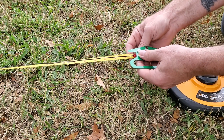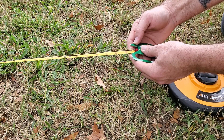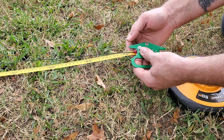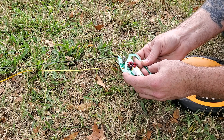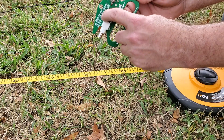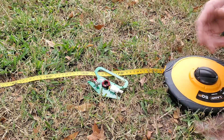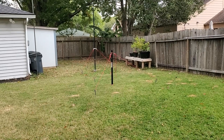So looking at my measurements here, I'm at 28 feet 7 inches, or in metric that would be 8 meters 72 centimeters in length. So with that being said, 28 feet on here — it looks like I'm set up for 20 meters. According to the little chart on the antenna, it tells you the different bands and what length of wire you need. So I'll get this hooked up on the pole — I've got the little pole set up out here — run a reading and see what we get.